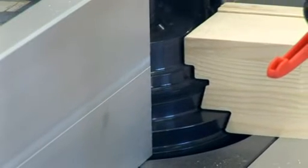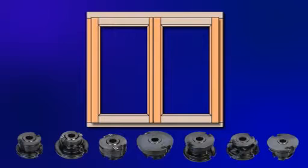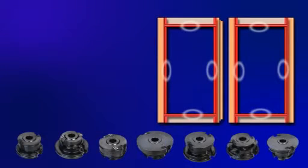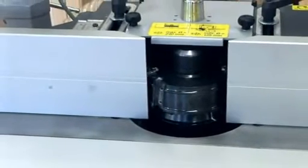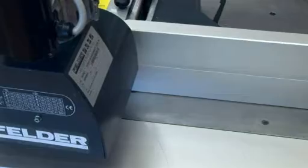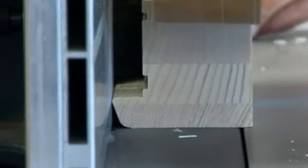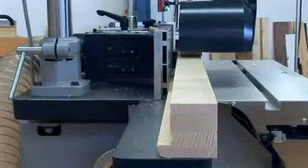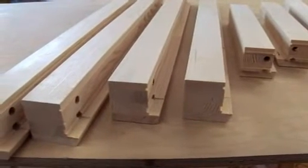Due to the position of the knives in the tool, you are assured of a fantastic finish even when making deep cuts. The third step is the inner profile of the window. The power feeder ensures that you can work safely and easily, and the carpenter's triangle is set face up during each working process.